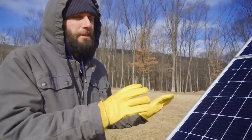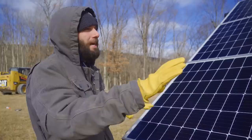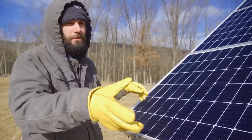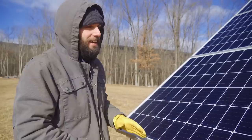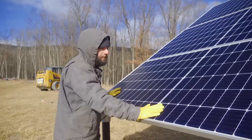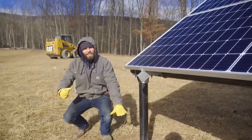These old panels are the same size as the new panels, and the four rows of these are 26.5 feet. So we're going to rearrange this array to match the new array, because the new array is 4 tall and 5 long. This old array is 3 tall, 4 long, so we're going to flip-flop them and go 4 tall, 3 long this way. So one of the new panels is going to sit in this location. 4 wide is 26.5 feet. One new row goes here, so we need to go 26.5 feet from here out. If we can make that work with this portion not being low to the ground as the land comes down this way, we're going to take the entire thing that way.